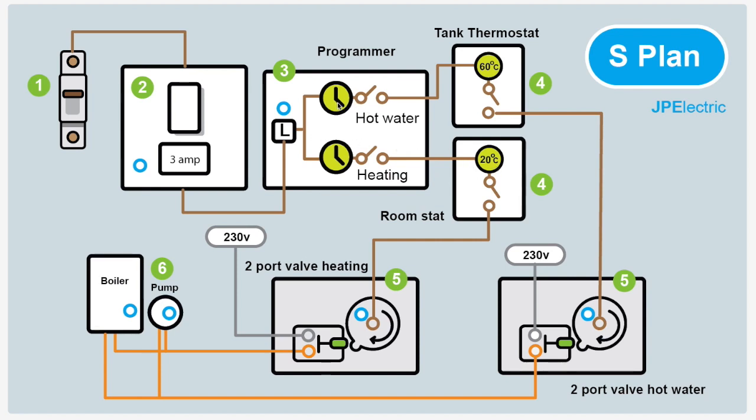In the case of hot water: do you want hot water on? Yes. It'll send the feed to the tank thermostat. The tank thermostat will ask: is it 60 degrees or not? If it's colder, it says I need heating up, so it'll send the feed on to the two-port valve. The two-port valve motor will rotate, and as it turns around, it presses a little micro switch which joins the permanent live feed in the two-port valve to the switch feed. And this switch feed goes off to the boiler and pump and energizes it.